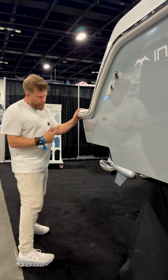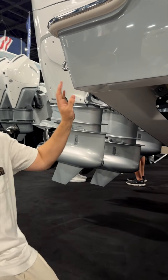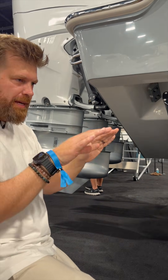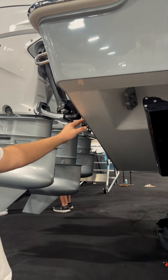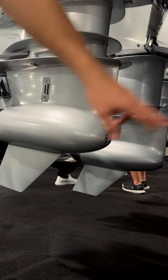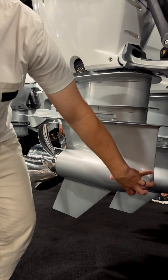And when we come right to the back, you have this bustle on the aft section. Your true transom is the aft section right at the back there. These are interceptor type blades, and what they do is they're constantly making little changes, running the boat and trimming her for you — like automatic trim tabs basically. But then this section has an overhang where the engines go. You can see you have the water pickup here on the Mercury lower unit, so the water will run straight off from the bottom of the boat and hit the gear cases — once you're planing, getting loads of cooling into the motors.